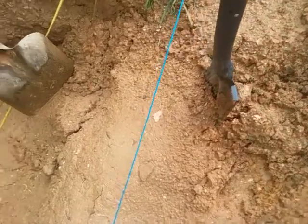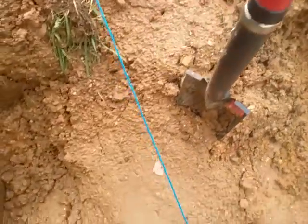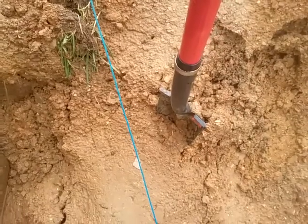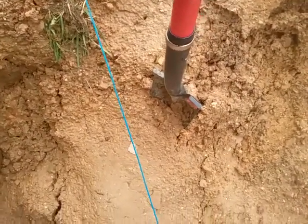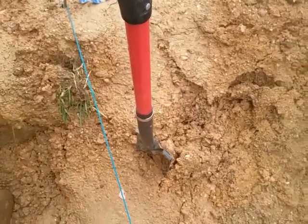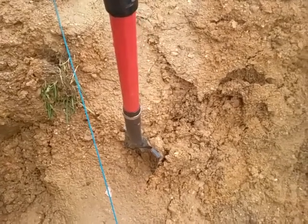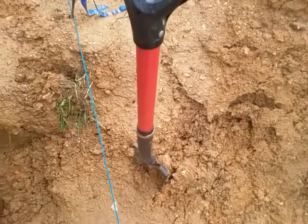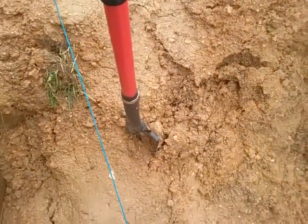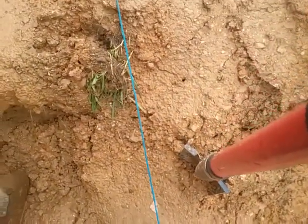what I was saying is, the reason the line is there is to dig down in this area, climate. The water line is supposed to be 36 inches, 3 feet. That's the frost line. Not really code or anything like that. I don't know what the code is exactly, but you would think it would be at least the frost line or greater. So doing this logically, but they ain't gonna put down the, can I show you?